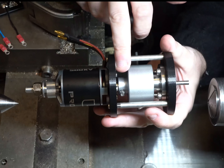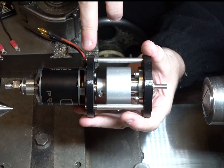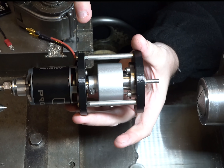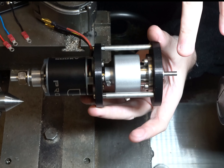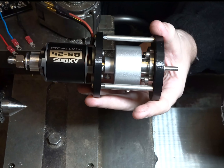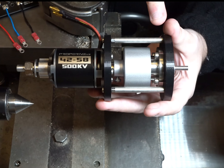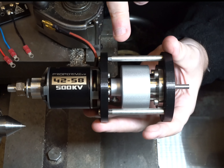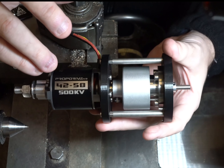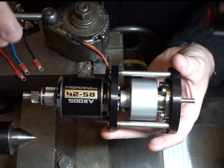The interesting thing is this bit, and this is what it's being created for — it's a prototype for the Tesla turbine and it's a magnetic coupling. It's not immediately obvious, but there is no physical connection between this shaft and this motor, despite that when I turn it, everything moves. The way that it all works is that there is a seal that completely seals the internals of the actual turbine, and there's some magnets on the inside and some magnets on the outside. They're positioned accordingly so that when the one rotates, the other one turns with it — it's forcing it round.